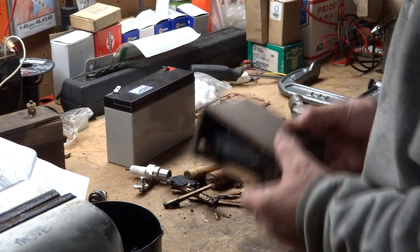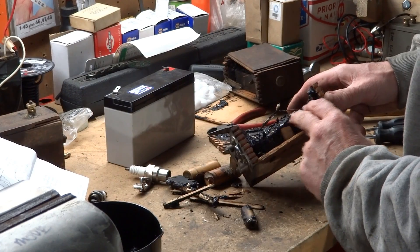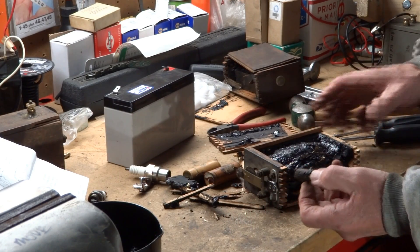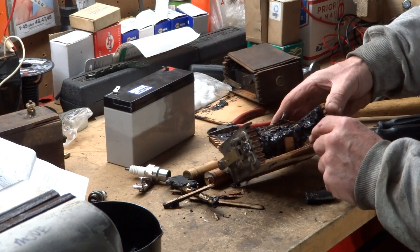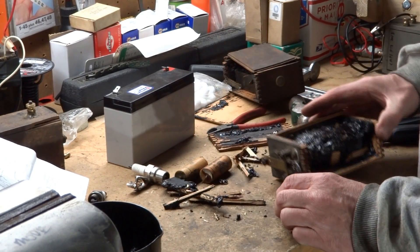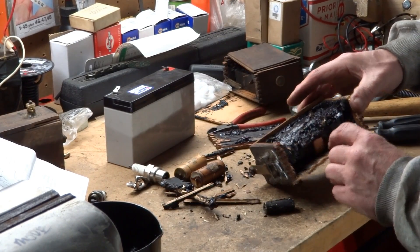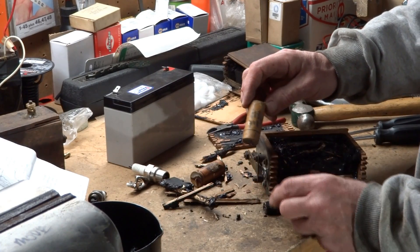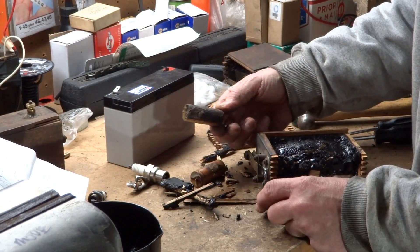Some interesting things have transpired. Somebody had been in here at one point, dug out the old full-length capacitor and the piece of glass that was in here. I found this little capacitor sitting in the bottom — how it was hooked up I'm not exactly sure. There's a wire coming off the backside of the movable point, but it dives down underneath the tar. There was a plate in the bottom, a little tiny piece of metal and paper — that disintegrated. I was expecting to find one of these wax capacitors — they're 0.47 microfarads at 400 volts — but these are old wax paper capacitors.